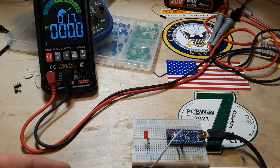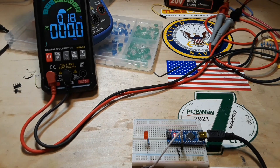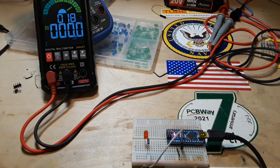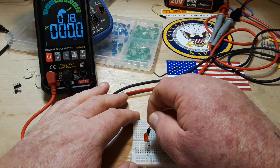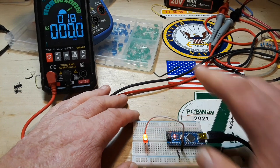You also have to keep in mind the total current, which would be 400 milliamps. So everything you have connected to your Arduino — 400 milliamps or less, all right? So let's get started with one of the most simple things you can do, which is to hook an LED up to your Arduino.